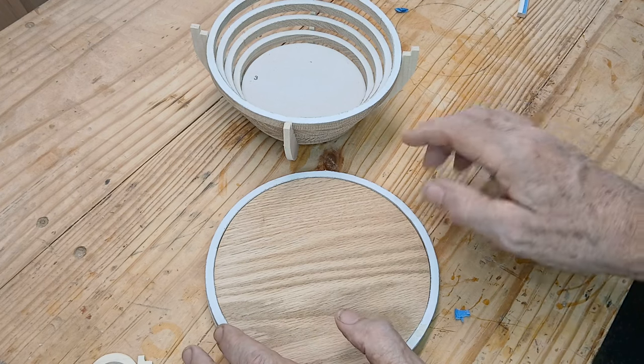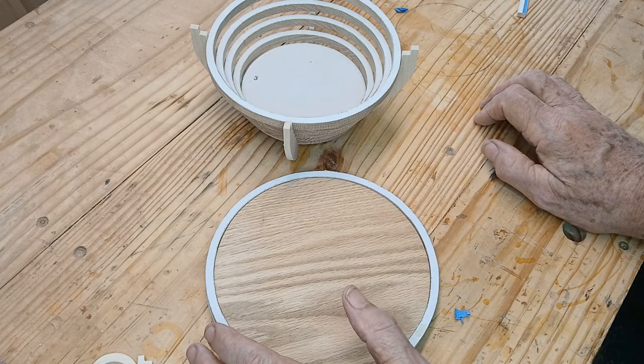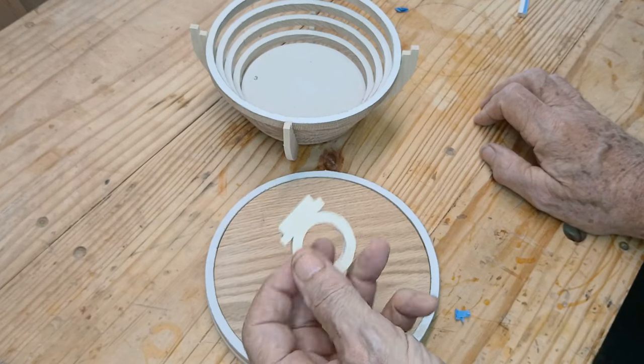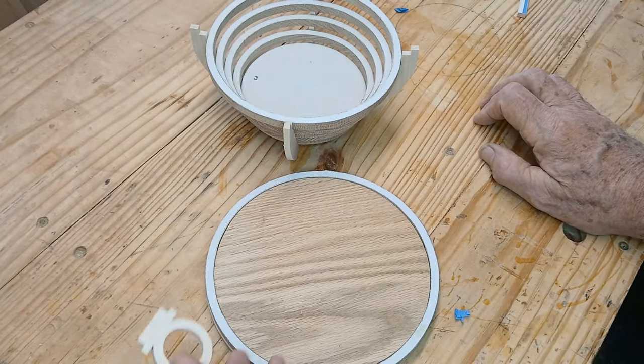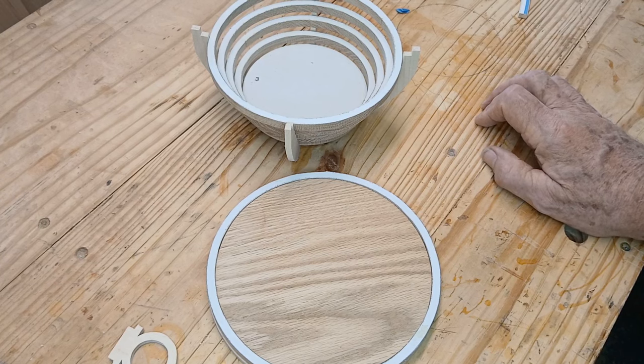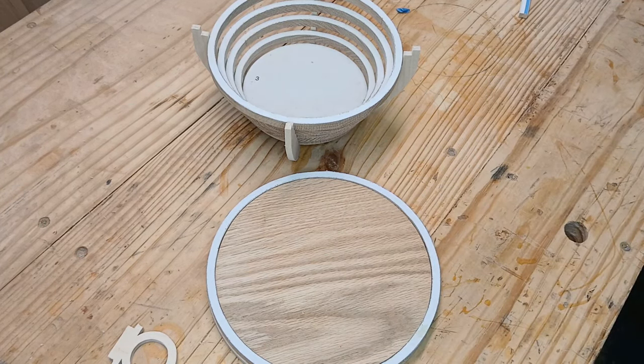The little slot in the bottom of these frame pieces fit together just right — I cut them really well. But the slot for this handle was a little bit tight, so I sanded that just a little bit and it fits really nice. I like a snug fit but I don't want to have to force it. First I'm going to glue this, then start working up on the basket itself.